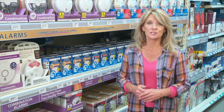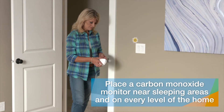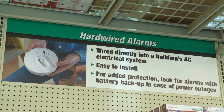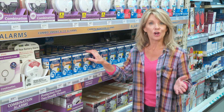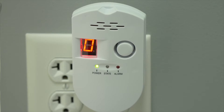That's why it's important to have a CO detector with an alarm. Carbon monoxide may build up due to a malfunction in your furnace or an improperly vented appliance or engine. Having a detector near your furnace as well as another detector in or near your primary living and sleeping spaces will allow you to be aware of the problem and get your family to fresh air and safety. Basic CO alarms are available in battery operated, plug-in, or hardwired models. Higher-end models provide dual function smoke, fire, and carbon monoxide detection, and some include a digital screen that shows you the CO level in your home at all times.